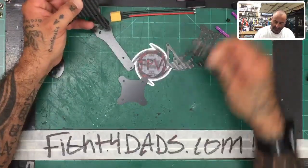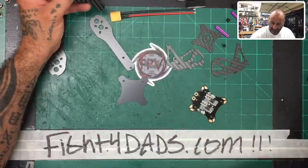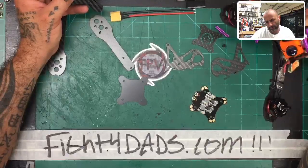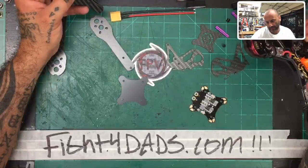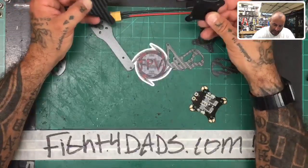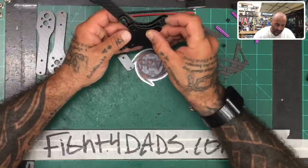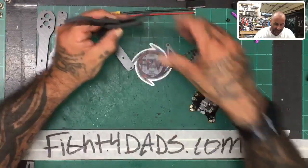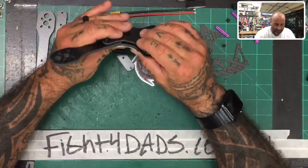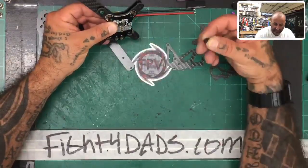And here's our PDB right here. And on the PDB, what I believe they intended to do with this, let me make sure that's what I did, because I put a plate under there. So they gave you a G10 FR4 plate. And as most of you know, I love this material. So on the G10 FR4, if you lay it down flat, then the PDB can touch the material, right? If you do not do that, you would short it out onto the carbon fiber. But if you do it like this, that shouldn't be a problem.